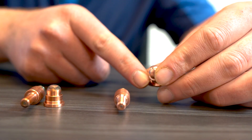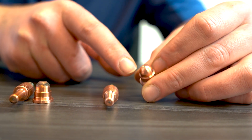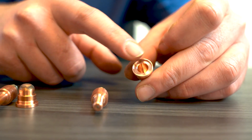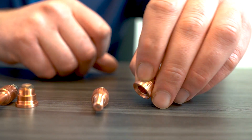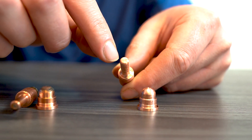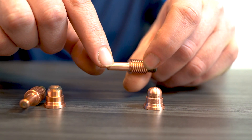This is what a brand new set of nozzle and electrodes look like. You'll see that it's got a perfectly uniform copper color. The hole is perfectly round. There's no scoring or marking anywhere in there. On the inside, you'll see that it's got a completely clean nozzle — no markings or anything there. That's just what your standard brand new nozzle looks like. Your electrode — you'll notice that it has a little gray marking up there, no scoring on the side, and it's a perfectly uniform copper color.